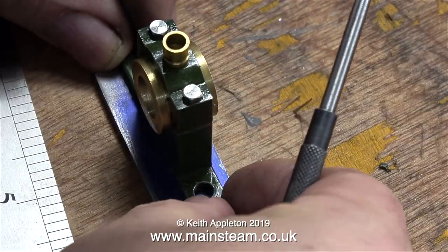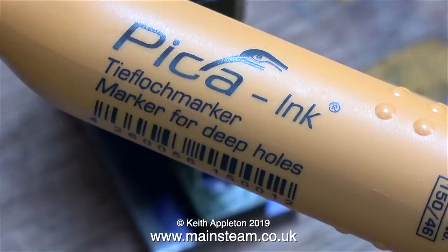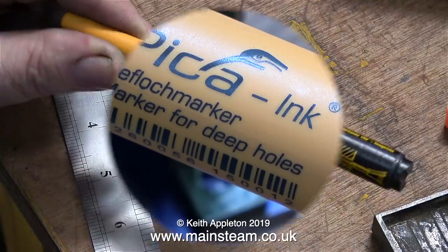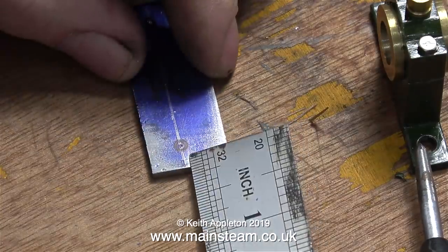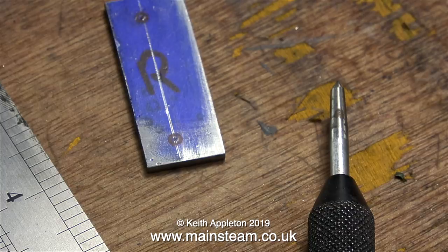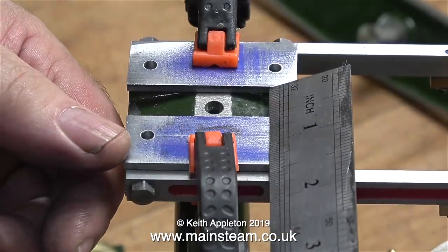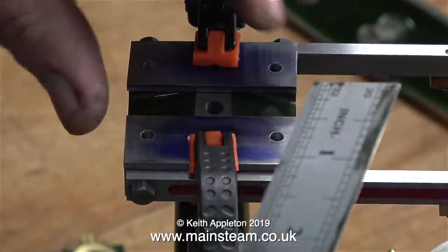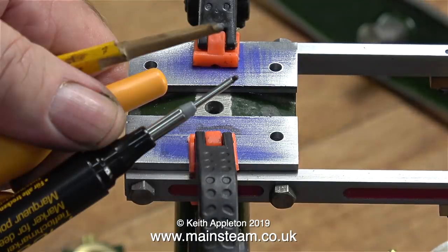A friend of mine, a man called Colin, called in to see me the other day and brought me something very useful. I need to transfer the position of the holes in the bearing blocks onto the pieces of steel, so I'm going to use this — it's a specialist tool, an ink marker for deep holes. It's got a really long point with a felt tip pen on the end. The felt tip pen marks show me where the holes need to be, and a centre punch followed by checking with the ruler tells me the holes are in exactly the right position. Thank you Colin — this will be far better than the pencil I used to grind down on my belt sander, after which it promptly used to break. The tip will go down into quite deep holes to mark the position on another surface.